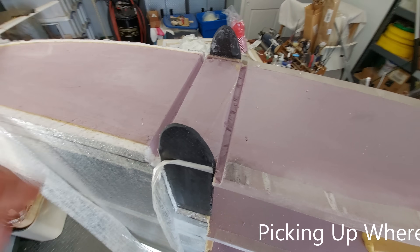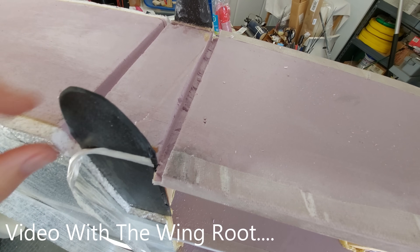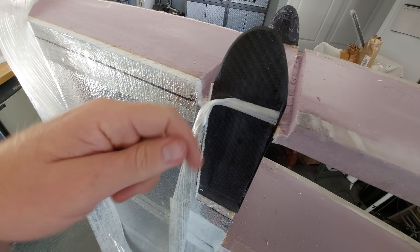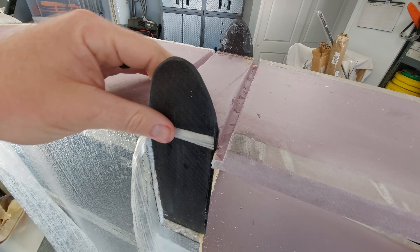I created a channel on both sides of the supports, then I'm going to take this fiberglass ribbon — secured it with CA here just to get it started — and I'm just going to wrap that around until I run out of uni. This is basically just going to keep the root from bursting.